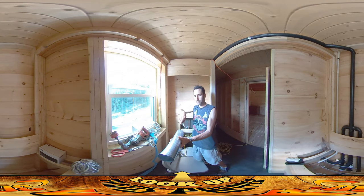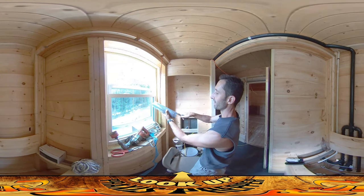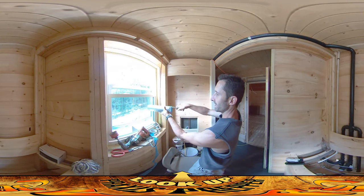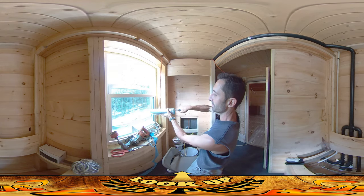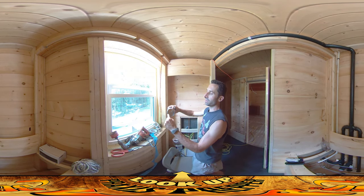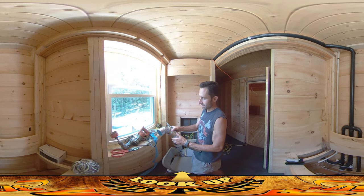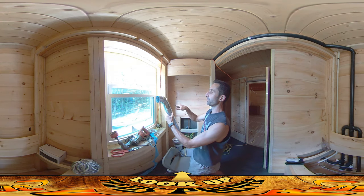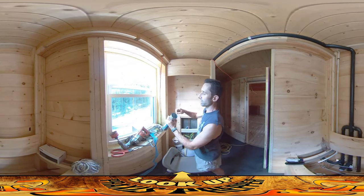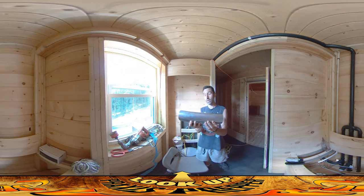There is probably a special tool for it — kind of like making pasta, pleating the edges — but if you take a pair of needle nose pliers, I took the liberty of practicing a bit before demoing this for you. Put them on there, do a little twist, then go over and another twist. It deforms it a little bit, but then you pull it right back out — you're getting that pleating edge. It doesn't have to look beautiful. The point is that when you put the pleats in, it shrinks it down and allows it to slide into the other side. I can already make it fit into this side here, so I'm pretty much done with that one. I could have made smaller pleats — I'm going to go in and make them so they don't kick in as much, because the more they're spread out, the less you're restricting the airflow.